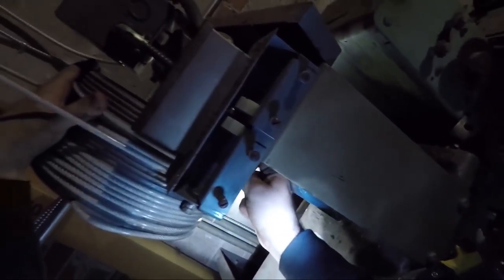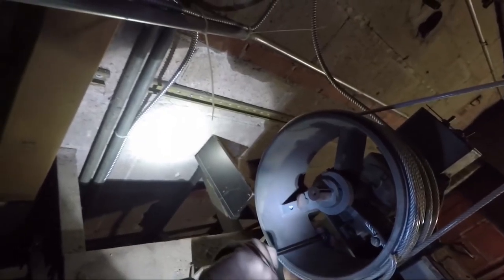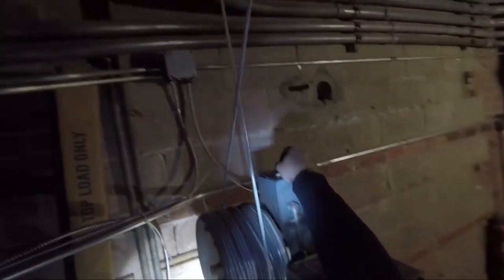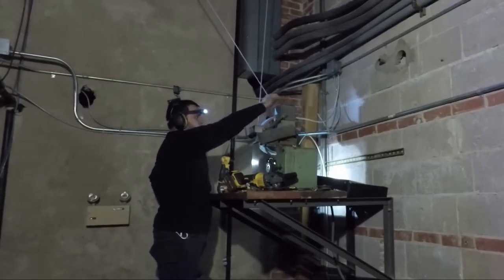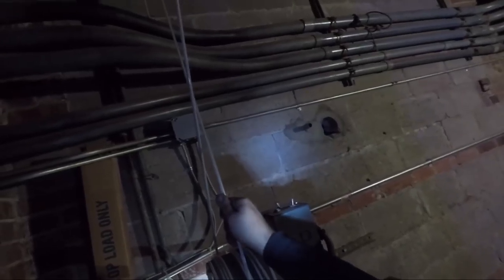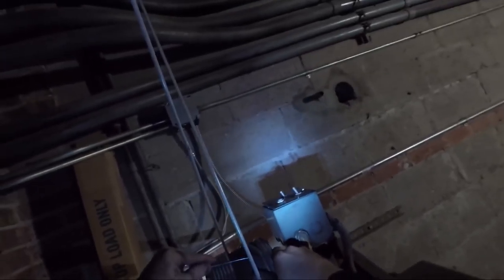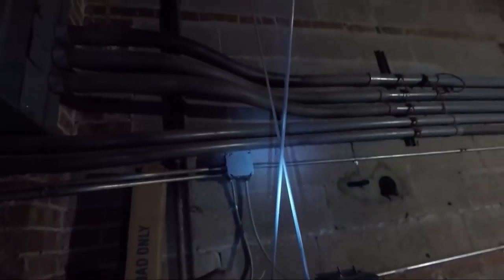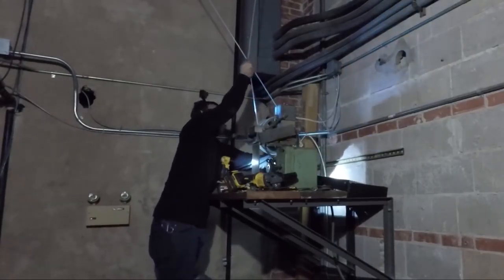On the control box right there you can see that there are two switches. The one in front is a safety cutoff and the one in back operates the system, and I am making sure to hit that safety cutoff every time because I would not want to get my sleeve pulled into this system — that would really wreck my day. It does also have an overload switch, but I'm pretty sure it would break my arm before that switch would trigger.